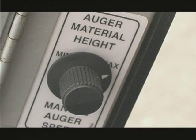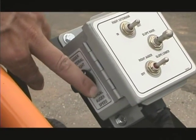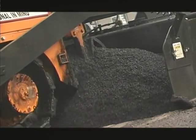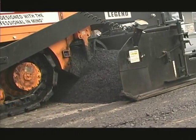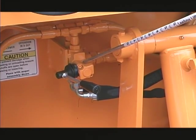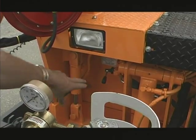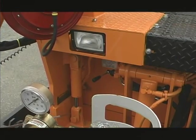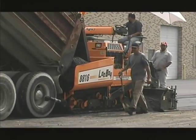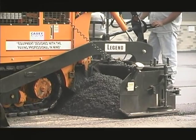To adjust the height of the material, start with the dial at 2 o'clock and adjust it counter clockwise for less material and clockwise for more material. Keep the extension full, making sure you don't overrun the extension with material or it can spill around the front of the end gate. The auger raise and lower valve is located under the seat on the left side of the machine. When raising or lowering the augers, this valve must be set to the auger raise and lower position. Then work the extension toggle at the left screed remote box to set the height. When paving, the auger should be all the way lowered. Anytime the augers are raised or lowered, the cutoffs must be open.